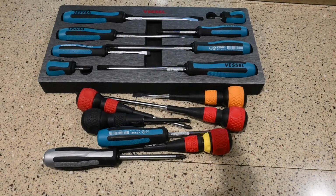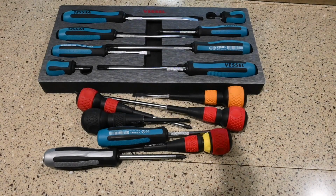One thing, however, you should be aware of is the common Phillips screw head. There's actually 3 different styles of Phillips heads. There's the one that we have in the USA, and then there's one called PosiDrive, which you'll find in Europe, which is not 100% compatible. And there's something called JIS, which often is called Phillips, but really isn't. JIS stands for Japanese Industrial Standard, and they differ from a standard Phillips screw head very slightly.